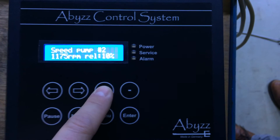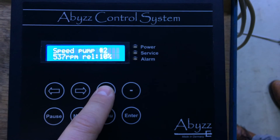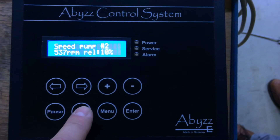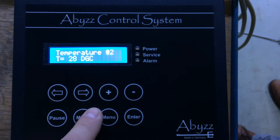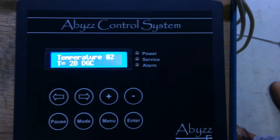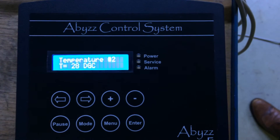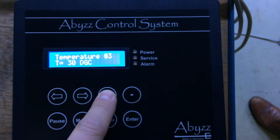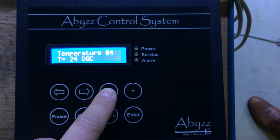You can switch to pump number 2 to see what that one is doing — it is running at 10%, doing 500 RPM. You can also find out the driver temperature, which is the temperature of the cooler on the back of the driver. That depends on the power the pump is currently using, and the reading is in degrees Celsius.